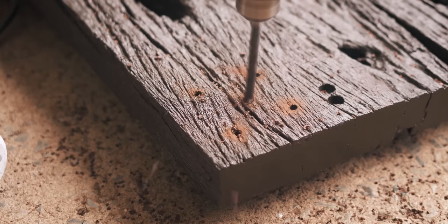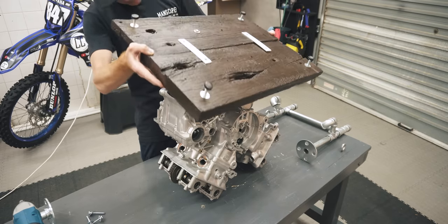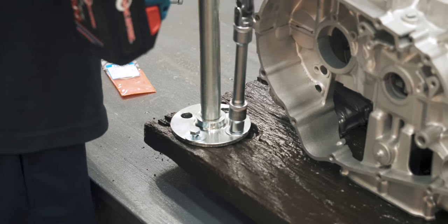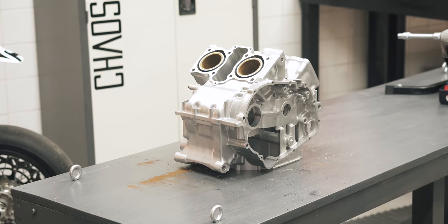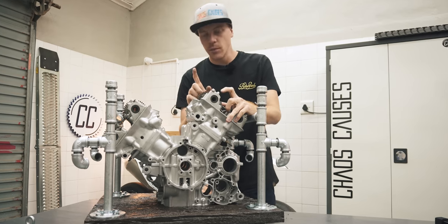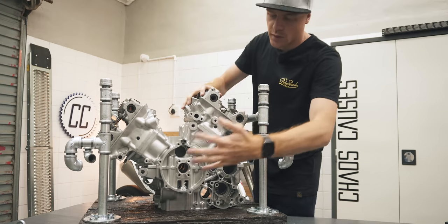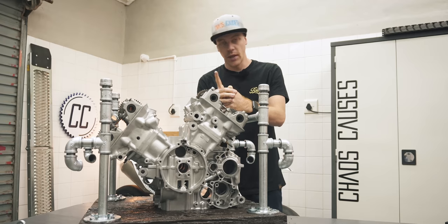With almost everything planned out, I drilled the final holes for the flange bolts and wiring, touched up the stain that I'd already scuffed up, and finally bolted the base to the motor — which was already stronger and heavier than it deserves to be. I even managed to bolt down my piping structures without splitting the base. In the end, I committed to having the cylinder heads attached, because without them the V shape just wasn't very distinctive with my tiny 400cc cylinders. It was definitely the right choice — this looks brilliant. I also gave up on mounting the engine at an angle to level the cylinder heads; once I put it down on the base, if the bottom of the engine isn't flush and the case join line isn't level, it kind of looks strange.